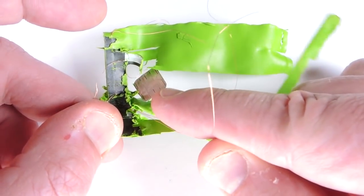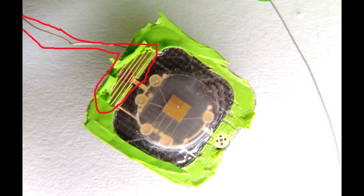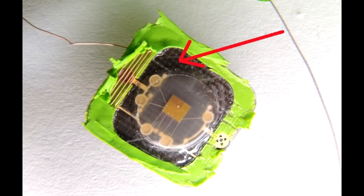Let's take a look at this assembly a bit closer. This is the circuit board that sits behind the gold contacts on the credit card. In the center there is an integrated circuit — it's basically a microcontroller, but a very special one meant for high security applications. There's a clear bit of epoxy which holds the integrated circuit on the board and protects the gold bond wires that go to the pads. And there's that little wire zigzagging back and forth — that's the antenna for the touch function of this credit card. Below that is a black circuit board.